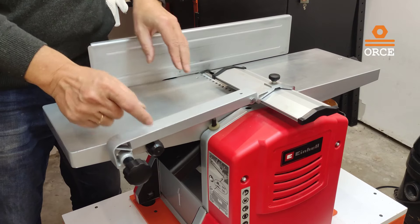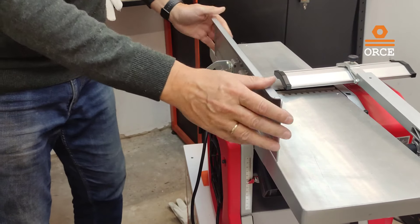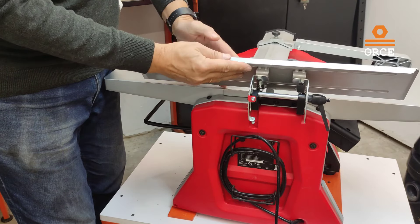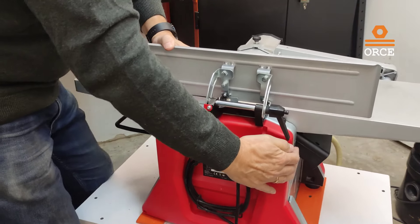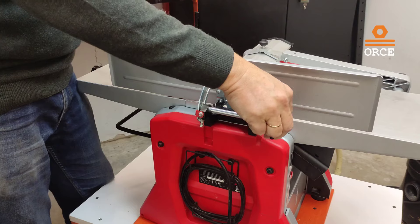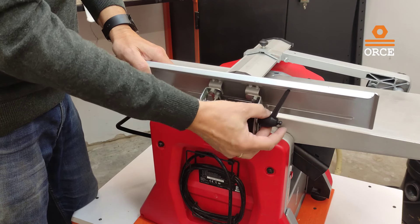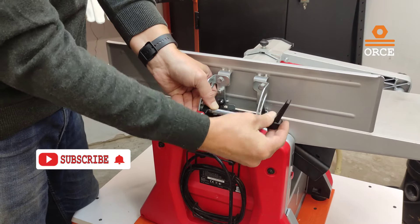After replacing these two knobs we are going to continue with our upgrade. Next thing is our fence. On the back side we have this handle that helps us lower the fence from 0 to 45 degrees. We can use this handle without problem when the fence is in the 90-degree position. But if you want to lower the fence, you can see that the handle is hitting the fence. This is not a design flaw — the solution is to press this handle, turn it like this, and then continue to tighten it in the desired position.